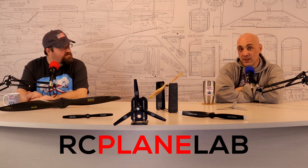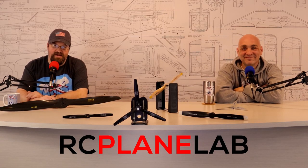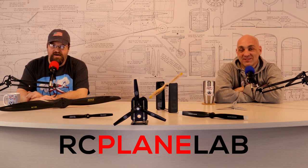So that's the process I use on my roller type prop balancer. I've never used a magnetic one, except for just watching Ron set his up here. So do you want to describe the technique you use? Yeah, pretty much it's the same as yours. You mount it on the spindle and do it the same way. It's just held on differently, with magnets as opposed to your rollers. But the process is the same no matter which balancer you use. Develop a technique and get yourself a process that's repeatable.